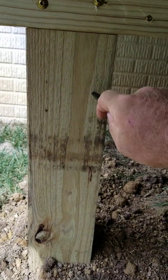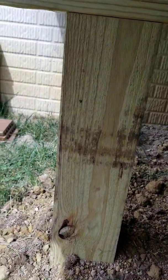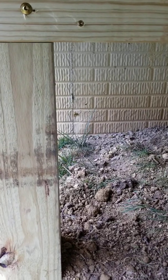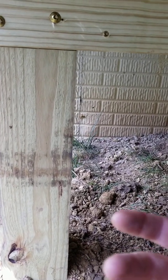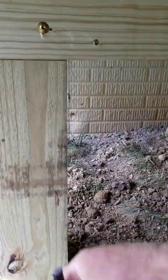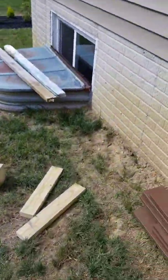I know this is a 90-degree angle — I use my square and I know it's plumb in every direction. I'm going to use a 6x6 as a piece of diagonal bracing instead of a 4x4 or even a 2x4, because a 6x6 just looks meaty — it looks like it belongs there. I think it looks silly when guys put a 2x4 diagonal brace on a two-ply 6x6 beam. That's just tacky. The 6x6 isn't incredibly difficult to cut — it just seems like it is.